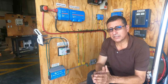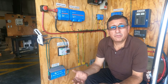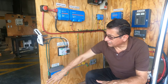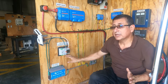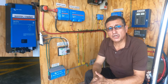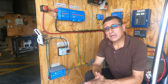We have here the connection of the shore power — this is a single phase project; if double phase, it is exactly the same. We have the connection here: hot, neutral, and ground. The generator will be located where I am seated; the generator enters here into the automatic transfer switch. From the output of the automatic transfer switch, we are going to connect the smart inverter charger.